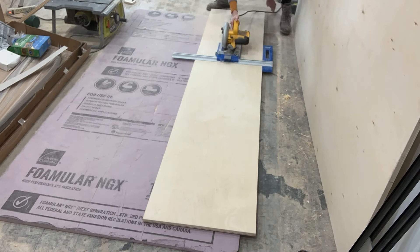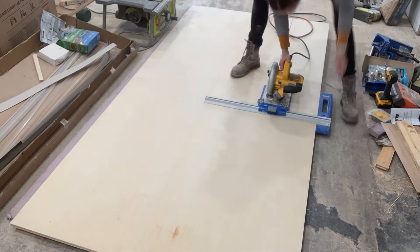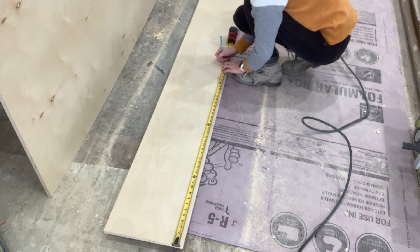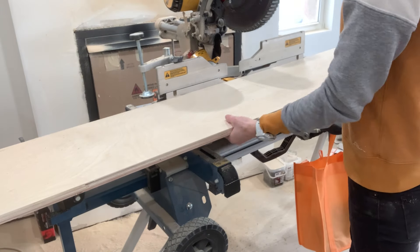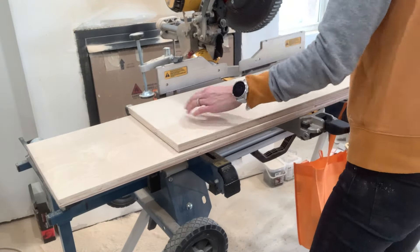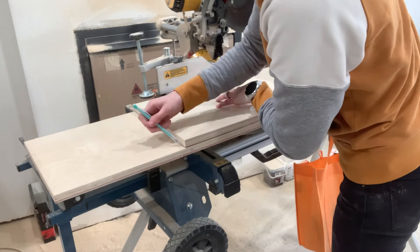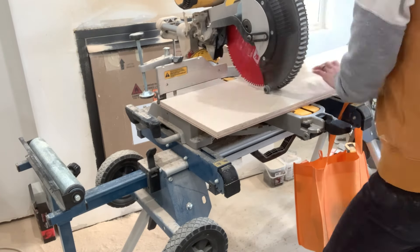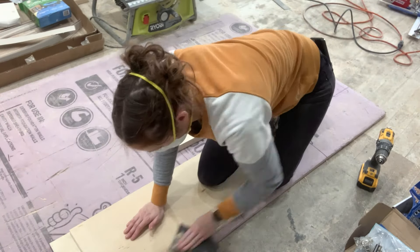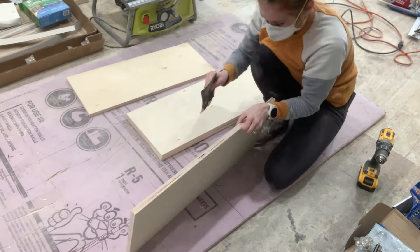I'm building the carcasses of the cabinets out of three-quarter inch plywood. The first thing I did was rip down to the depth I wanted my cabinet to be — in this case 12 inches — knowing my door would be another three-quarters of an inch on the front of that. I ripped down enough boards to make the sides, top, and bottom of my cabinet, then cut those to the appropriate height: 42 inches tall and about 30 inches wide. Then I sanded the sides from where I made my cuts on my chop saw, as it splintered the wood a little bit, just to clean it up before assembling everything.